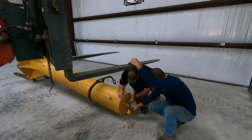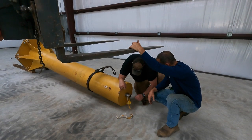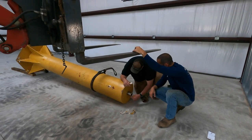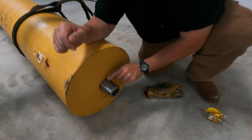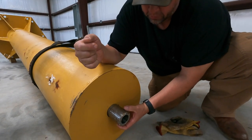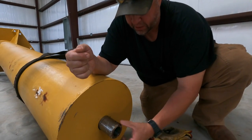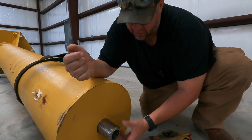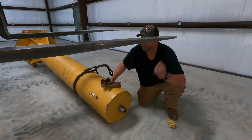It's probably got a bolt in there to choke it, but I don't know if it's welded to the backside — it's probably welded to this plate right here. This is the first time we've looked at the pin on the top side. What we're gonna do is go ahead and use a bolt right here in this hole — there's a cross hole — and just put a strap right here and actually pick it up right from this pin. I'm sure this has slipped through the plate and welded on the back side, maybe a flange even. That way it'll be dead center and you'll be able to rotate and spin it around.